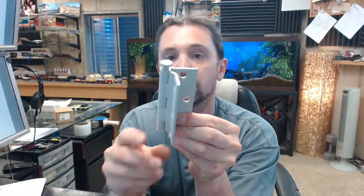In this video I want to bring you a closer look at the Bommer number 5300-035-600. This is a 3.5-inch half-surface, standard weight, plain bearing, prime-coated steel base hinge. This is a relatively uncommon hinge, being both half-surface and 3.5-inch. It's going to be pretty atypical. Half surface, not so uncommon, but you'll see that in a 4 or more commonly a 4.5-inch hinge.